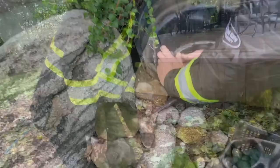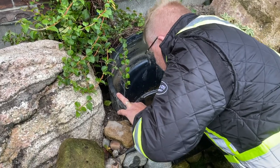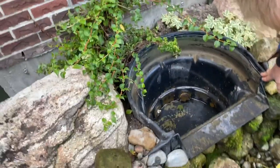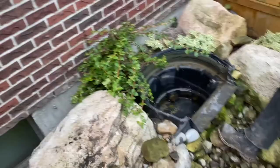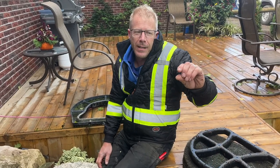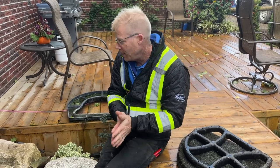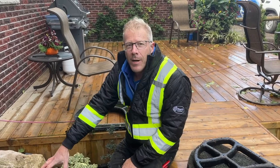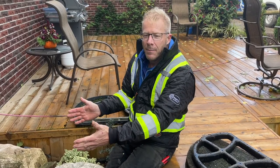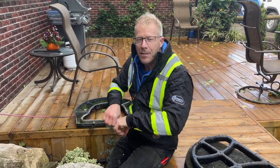So I'm going to go back to the top. Now on the bottom of this one — so now all the way from the spillway all the way to the skimmer, there's no water in that pipe. And if there is, it's very little. You could have a half inch or an inch of water freeze inside a two-inch pipe and that won't burst the pipe — there's plenty of air space still. But right now, no matter how much rain and snow I get in this basin, it's not going to get into that pipe. They even make the shape of these basins wedge-shaped towards the top, so as ice starts to push, it starts to push up as opposed to push out.